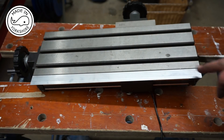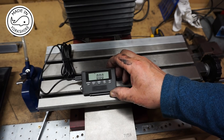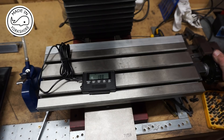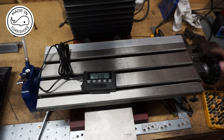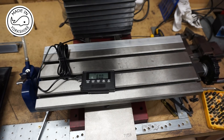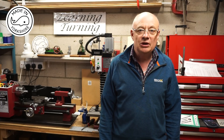That seems to have worked out pretty well, and it's nice and tidy. The cover isn't higher than the table. I must have done something wrong — something's going to go pear-shaped. But anyway, looks all right at the moment. As a rough test, one full turn of my hand wheel is equal to 2mm. Looks pretty good — very happy with that. I must say I found that to be extremely straightforward, and I hope you found it of some use. In my next video I'll be tackling the Y axis.